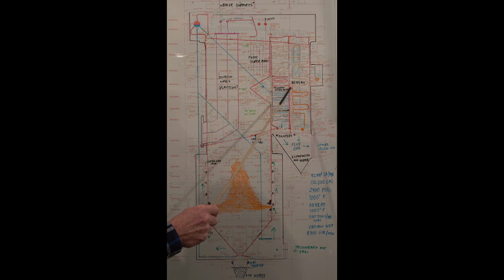They have acoustic leak detectors that'll look for tube leaks. They measure high frequency noise, and they're fairly good at finding tube leaks, but they also pick up soot blower running. The big thing with operators is to make sure the soot blowers are running. These lances will bend. They're going in about 30 feet or so. The high temperatures, it doesn't take long for them to start bending, especially without steam flow on them.